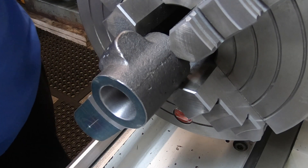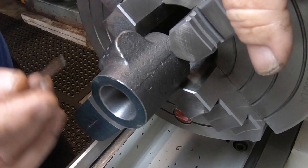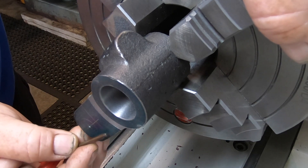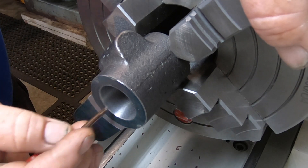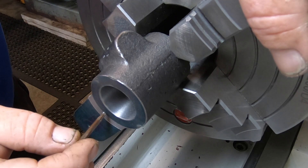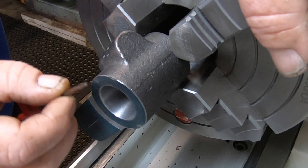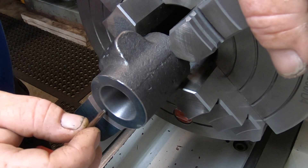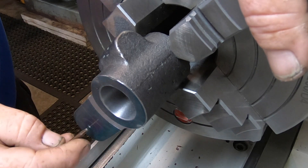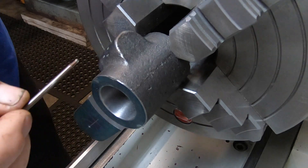It's not raining today. We had about a 36-hour period of about 190 mil. You can see a faint pencil line here — it's an inch and a half from the centre of this boss out to here. This mark here is an inch and a quarter, roughly. I've got to put an eighth-of-an-inch recess in — that inch and a quarter is pretty important. And out to this line here, which is clearance for a back plate. After that, a 5/8 reamed hole in here, and it has to be split through there.